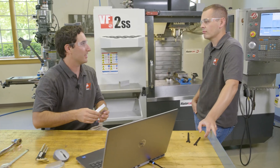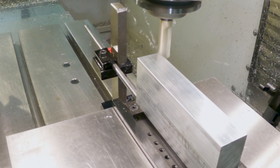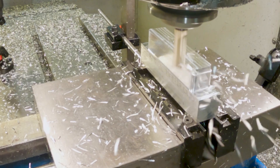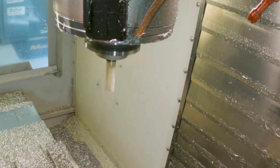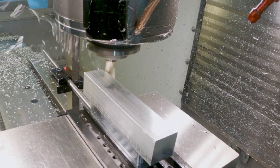Let's throw some new stock in the machine and run through the process. Let's check it out. The toolpaths on the first setup are straightforward — a simple facing operation, then roughing, and then finally a finished contour. When finished, I'll flip the part over and run OP2. OP2 is the bulk of the machining process. Notice the efficiency of the OptiRest since we have the stock properly defined.